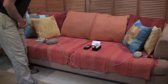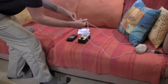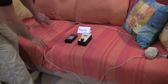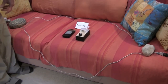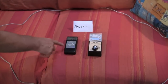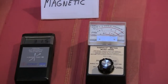I'm going to show you a little bit of that right now. I have the same setup with two filters plugged in, but instead of the wires being close together, I've taken an extension cord and split it — separated the two conductors. This is what happens in buildings sometimes: electricity goes in on one cable and if there's a wiring error, it returns through somewhere else. In a building you can have net current on one side and stray current on another, and in the middle you get high magnetic fields. Right now, the bell meter is around 31.5 and at that same distance it's still reading 31. On the tri-field, we're on the 0–100 setting and we've pegged this meter — way over 100.